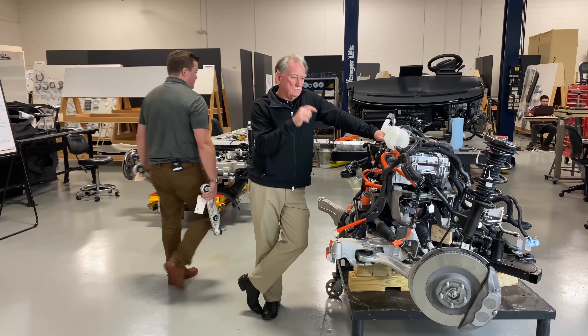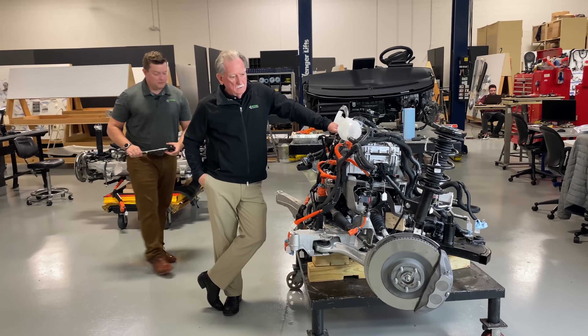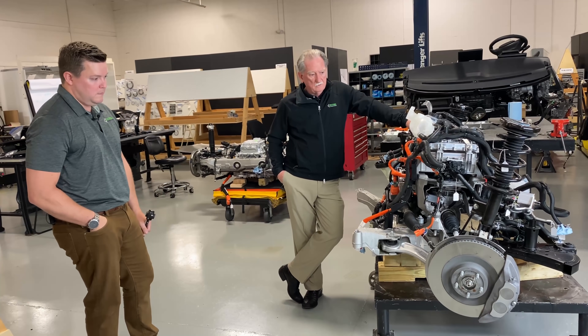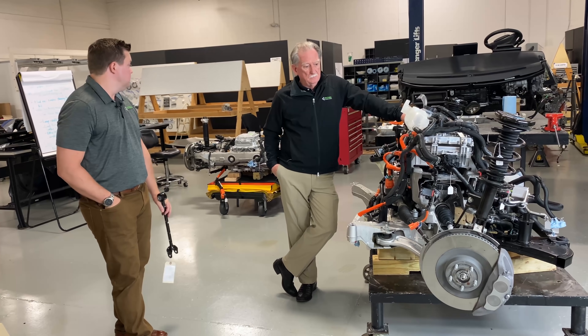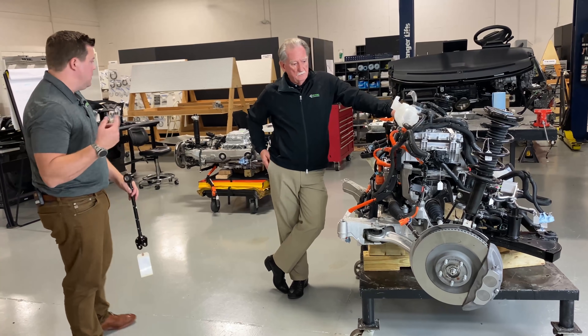If there's one complaint: when Sandy and I took our road trip, when we're backing in or parking or turning in a parking lot, it really is not the best turning circle. But the benefit you get is when you're actually driving the vehicle, it tracks on center better and the stability is far superior. The only advantage with just the McPherson strut is it's wicked cheap in comparison. It's a less expensive, more conventional route. So if you're looking for price reduction, there you go — but if you're looking for a BMW ride, you're going to be looking at virtual ball.